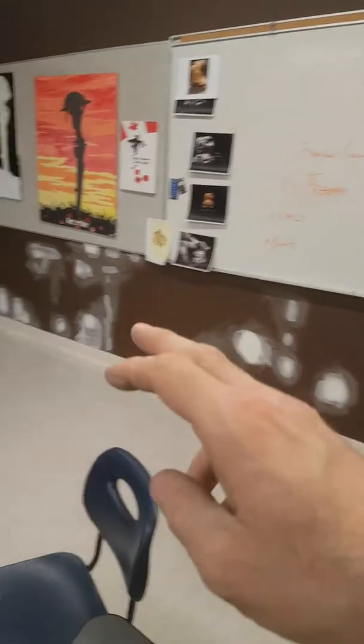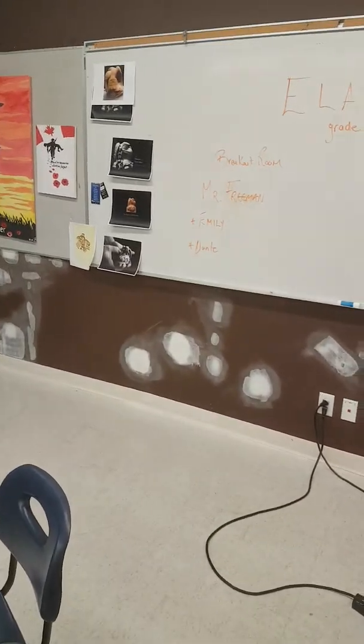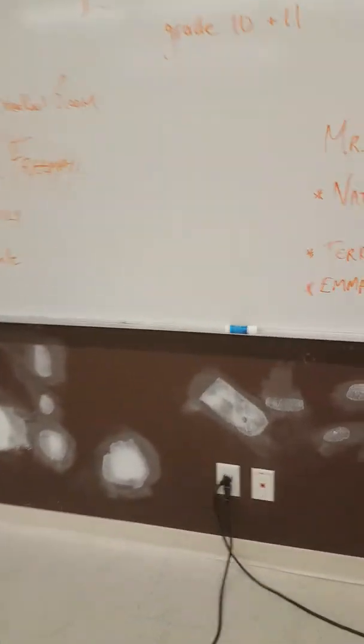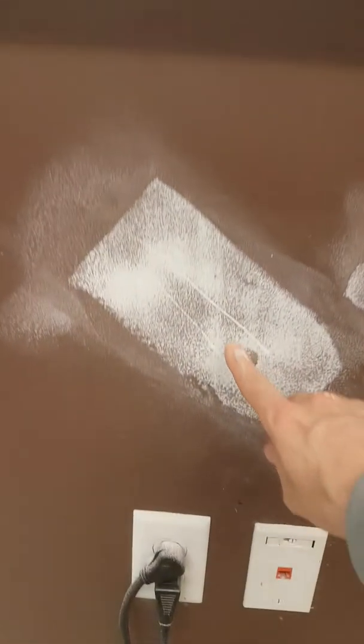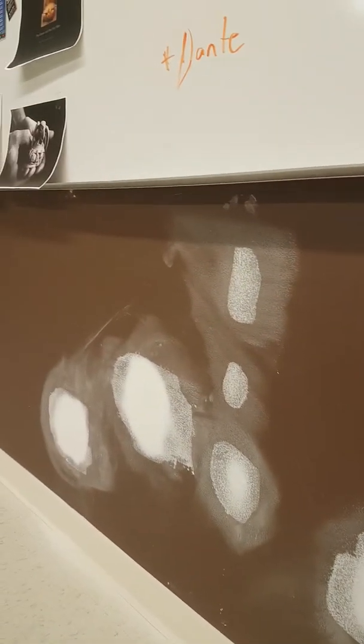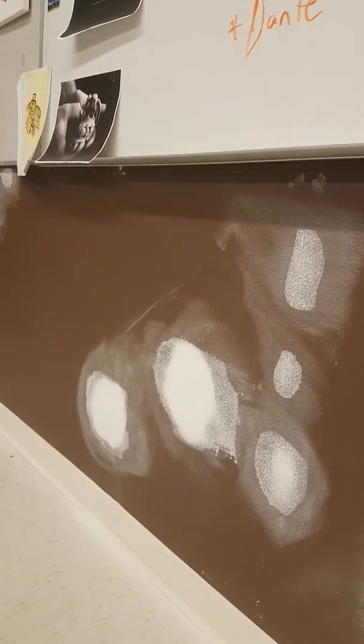As you can see here, we've sanded down and we're ready for paint in this particular room. Sanded down all the dents and dings, but we have a lot of things like stringers — long scrapes — this is all filled and smooth now. There's a lot of that kind of damage. So I've put a good layer of mud on all those areas and they'll smooth out.